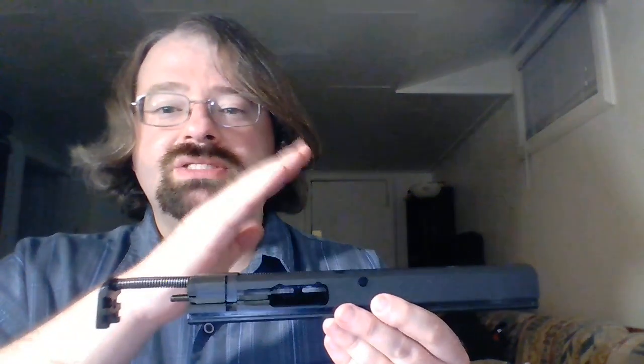That main advantage is that it minimizes barrel flip. With a lot of blowback guns that would be more conventionally laid out with the bolt behind the breech face, the center of mass will wind up moving behind your hand, that is your primary hand, that is the pivot point for the gun. And if the main mass of the gun moves behind your hand, it's going to cause your hand to rotate usually, and of course the barrel rises up, and that makes the gun less controllable, especially if it is a military gun that is select fire and you've put it into full auto.